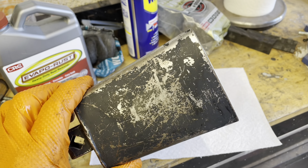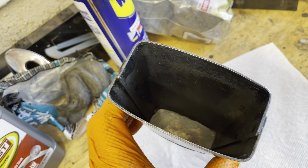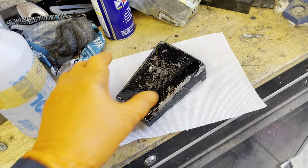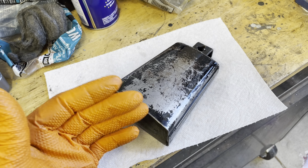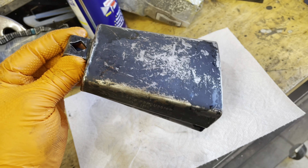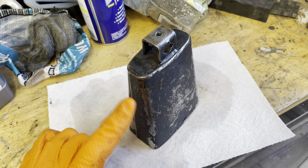Slight change of plans. I cleaned this bell up with the zero steel wool and used the WD-40, got it inside and out. However, there's a little bit of rust at the bottom that's hard to reach. I'm going to finish cleaning all the WD-40 off using lacquer thinner — I keep it in a spray bottle, just spray stuff down to de-grease. You can use paint thinner, acetone, or alcohol, but lacquer thinner is really great and it dries super fast. It'll get all the grease and oil off and then you're ready for paint. I'm going to go ahead and paint this straight away with some automotive paint.